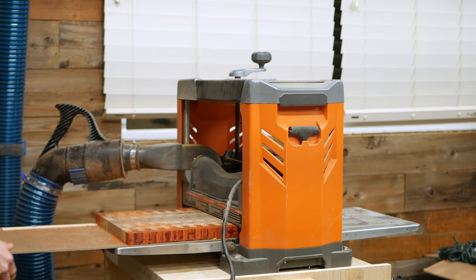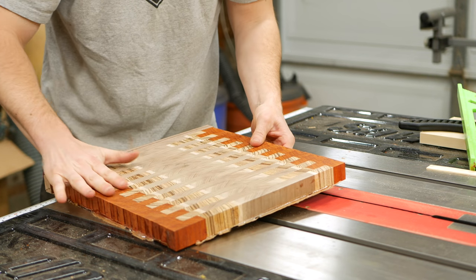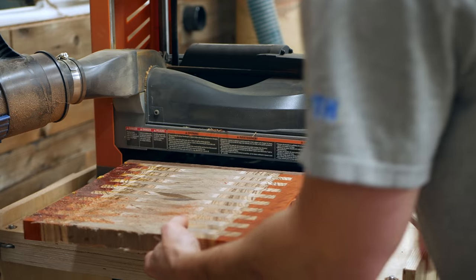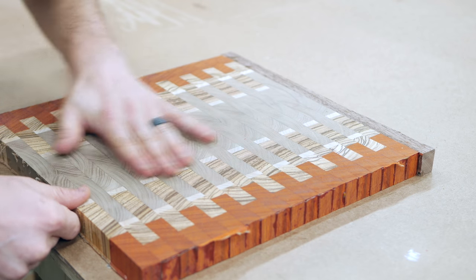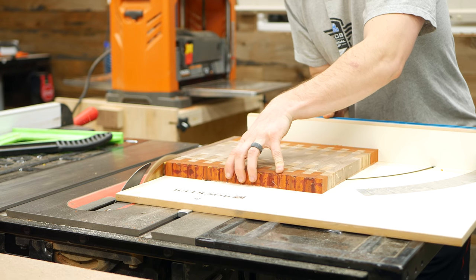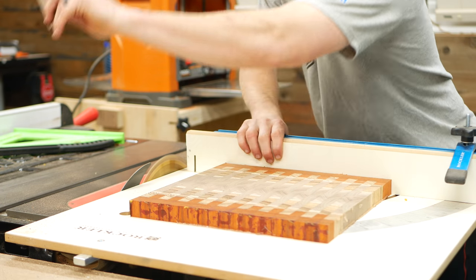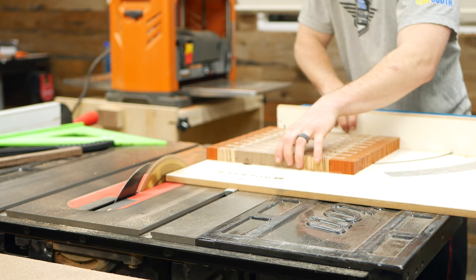I ended up using a flat sled as a reference surface and used a really thin shim to stabilize the piece as I ran it through the planer. By doing so it created one perfectly flat side that I could then flip around and run that flat side through the planer again, giving me perfectly even surfaces on each side. Do what you feel comfortable doing for this step in order to get a flat surface. Because I used new blades and took very light passes, I was able to achieve a very clean surface. I could then go back to the table saw and use the pattern as my straight line reference to square up all four sides. It's really important to take your time measuring and lining things up here so that you don't end up squaring the edges slightly at an angle, because your piece can actually start to look kind of crooked.